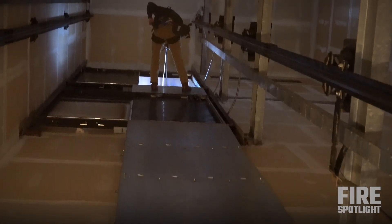We're looking at doing a very simple pickoff — for lack of a better term. We establish either a high anchor or high directional, lower a person or let a person rappel down the shaft, get to the top, access via the car top access hatch, get the person, put them on a harness, and raise them back up. It's very much in the realm of rope operations.